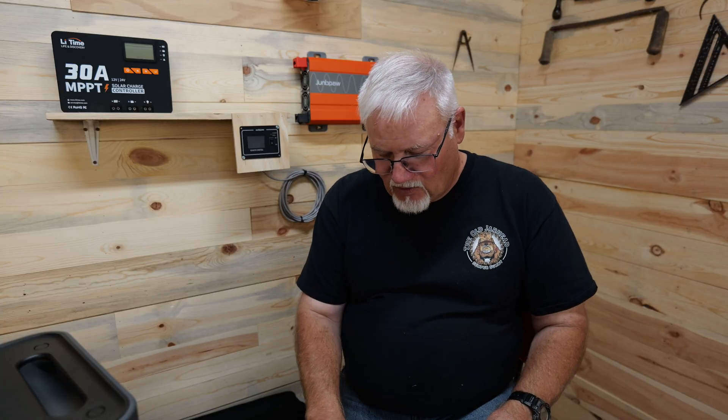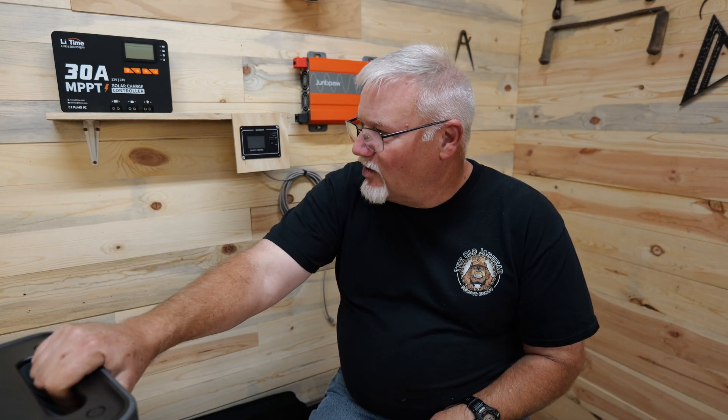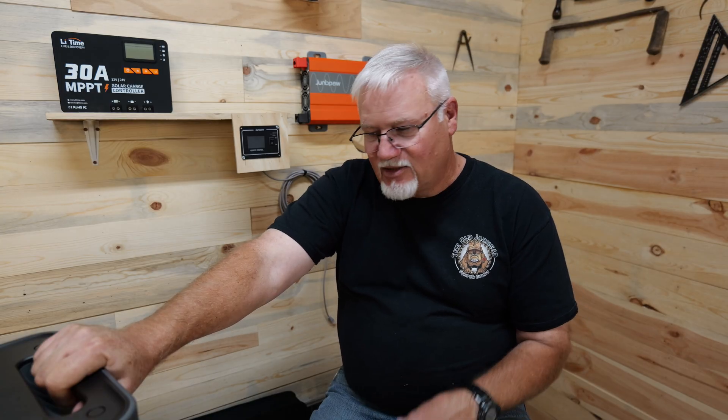It's nice when the apps work. We're going to let this run and charge at 1200 watts until it's fully charged up, and we'll see how much power it took to fully charge back up again. We used 1560 watt hours to run the heater until we got to 10%, and starting from 10% back to 100% will use a certain amount of power, so I can take the difference to see how much the inverter and electronics actually used.